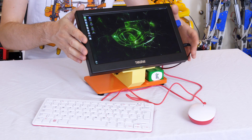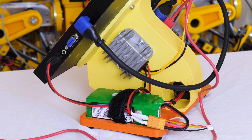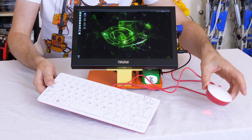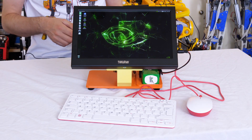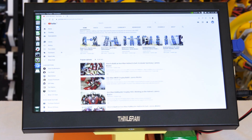I've built my Jetson Nano into this little terminal-looking thing with a couple of 3D prints. We've got a battery, a volt meter and a regulator so we can power it, and I got this 11-inch screen off eBay. I'm using a USB keyboard and mouse - actually the official Raspberry Pi keyboard and mouse from the desktop set. It boots Ubuntu 18.04 from an SD image you flash; I've put a Wi-Fi dongle in mine so it's truly portable with the battery and screen, a bit like having a mobile computer, and of course it runs Linux so we've got a browser and everything else we need.